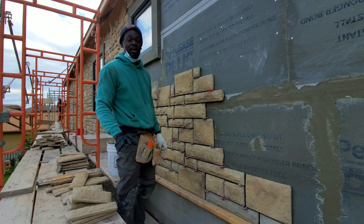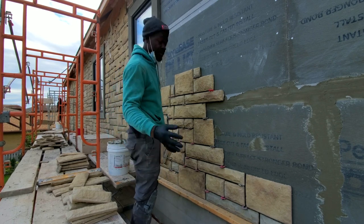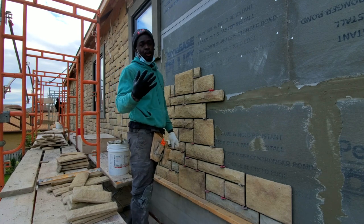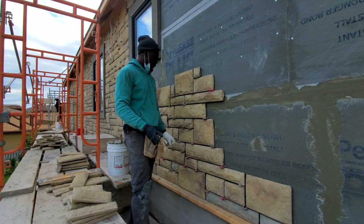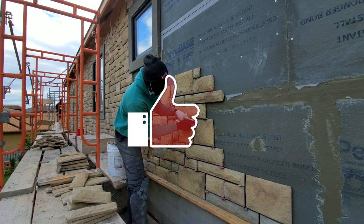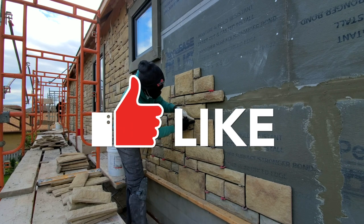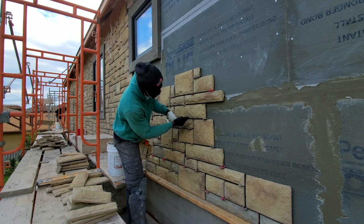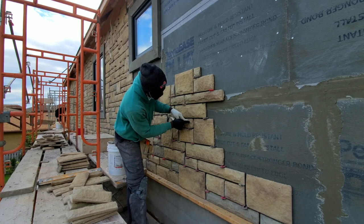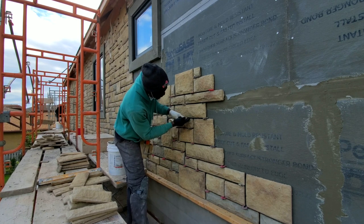I'm going to wrap it up here but I want to recap what I explained. The most important part: you don't want to go no higher than the biggest size stone you have — in my case it's this one. Once you reach the biggest size stone you have to put one across just like I did here. The medium and the small have to add up to be the same as the big, but once you reach that height you have to put one across.